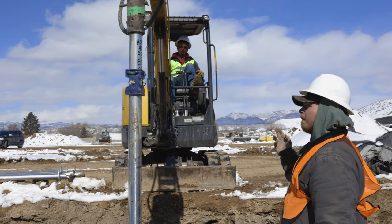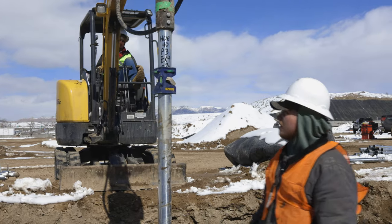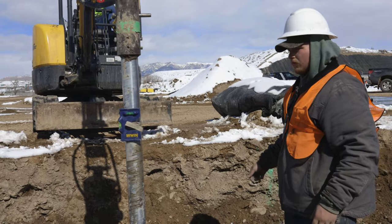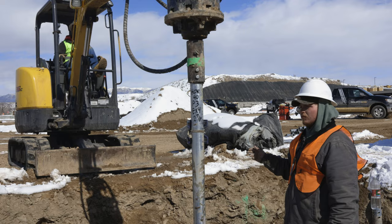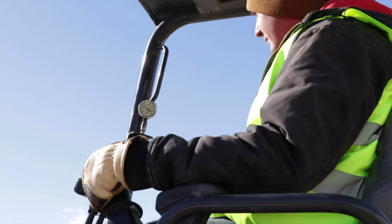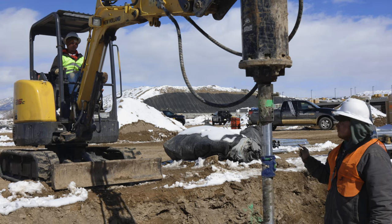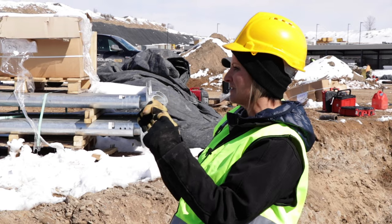You'll notice this is a low-speed, high-torque drill — not your standard auger drill that goes around super fast constantly. Our spotters will give feedback every rotation to keep that pile as straight as possible going into the ground. You can see Jordan up there making slight modifications as he goes because he can see the level on his perspective, and the spotter can see his perspective as well. Being able to go both ways makes it a very dynamic duo, so they can make very minor adjustments every single rotation.